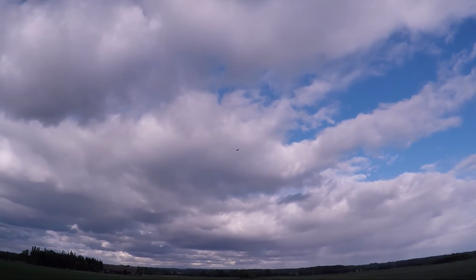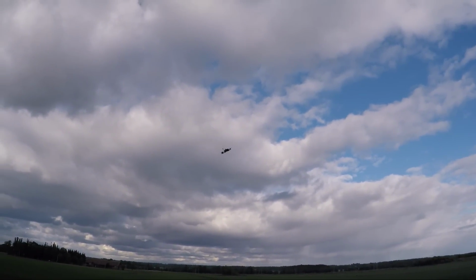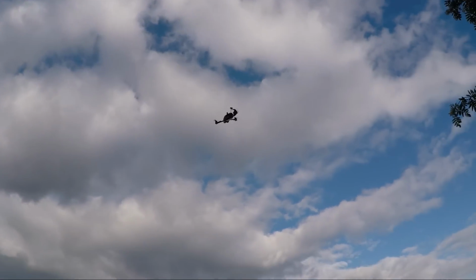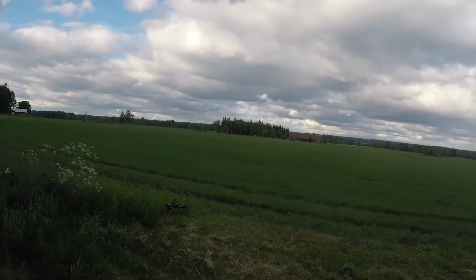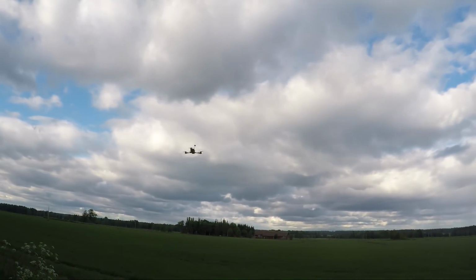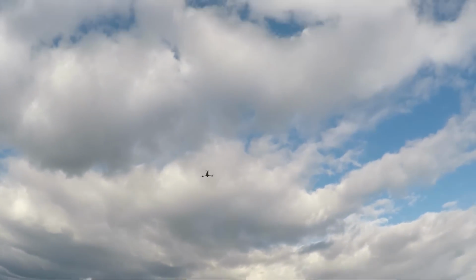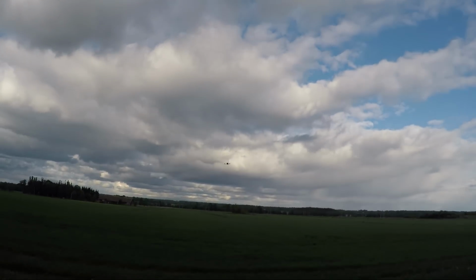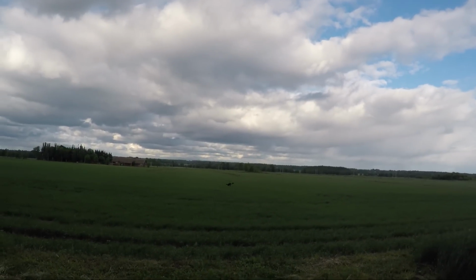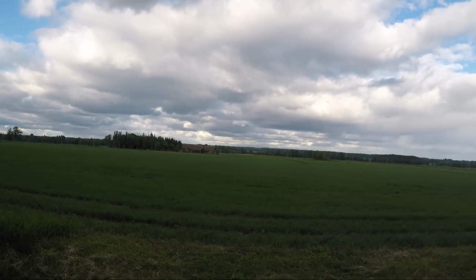The tail tune can be done in any flight mode, so you can use horizon or angle mode to make it a little bit easier for you if you're not used to flying acro. Also, do this tune on a calm day. You can do the tail tune without a beeper, just hover for a really long time so you're 100% sure you got a good value and then save it. But I really recommend getting a beeper. It's awesome to have the lost beeper alarm on the copter as well.